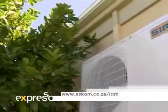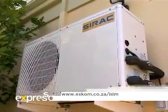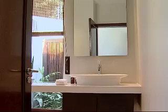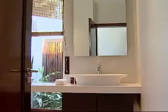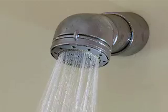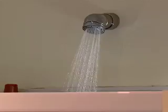Will the heat pump work as efficiently as a conventional geyser? We asked a homeowner. We installed it about 18 months ago. When we initially installed it we did a test — we put the geyser on its own and took it to 60 degrees, then turned that off. Once the water settled to about 15 degrees, we switched on the heat pump and let it go to 60 degrees as well. We used about 25 to 30% of the energy we would normally use on the geyser element.